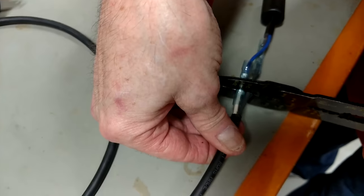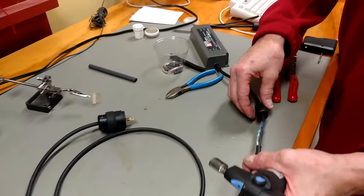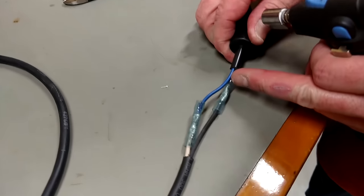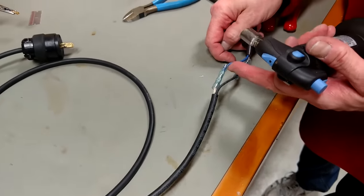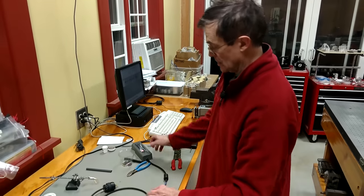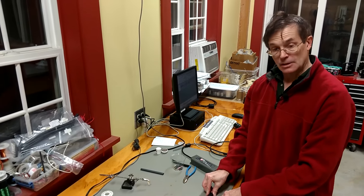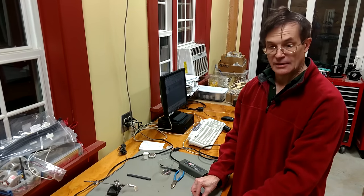Taking the heat gun, heat the connectors to shrink the tubing and reduce their size — this one also has an adhesive lining, providing a better connection. The alternating wire lengths give a very tight, neat connection. I've used the same method for the power cord and the dimming control leads: cutting each lead a different length so when packed together, it makes a much neater installation.